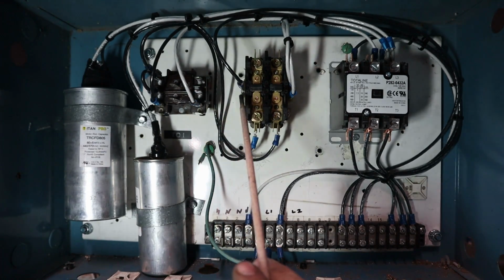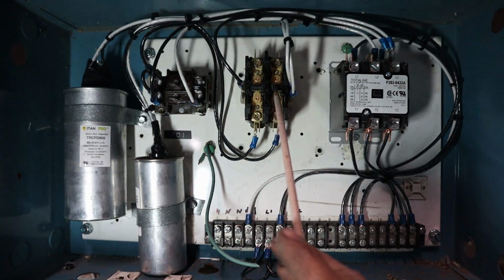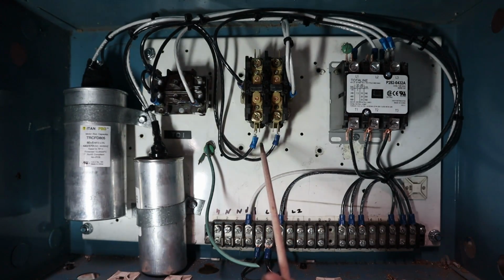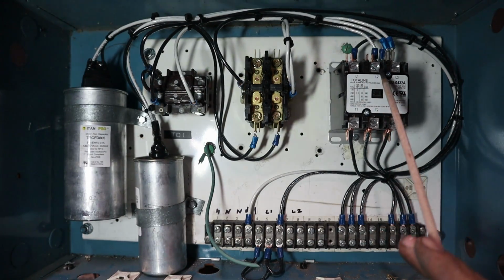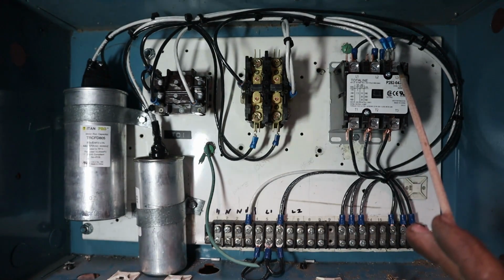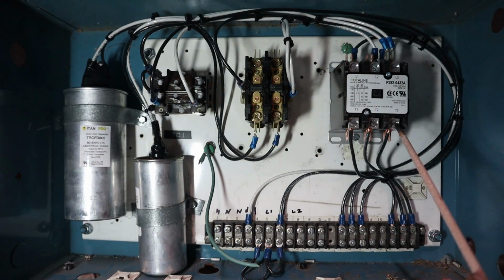Once that pony motor kicks on, that motor gets spinning, I'll flick the switch to energize this contactor. When that makes, it'll actually put power out to that motor. Now, aside from putting power out to that motor, I have to run 2 wires from here to the line side of this contactor, and that's going to be 2 of the legs to run the hacksaw, and then the third leg is actually going to be generated by this. Our third leg is going to come from our idler motor into here, and then it's going to tie into the third leg of the hacksaw.